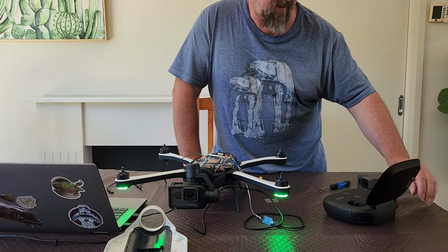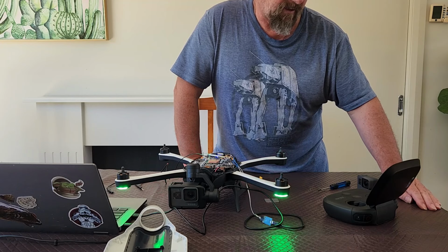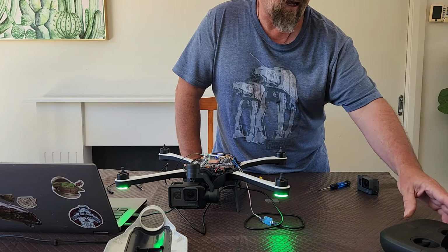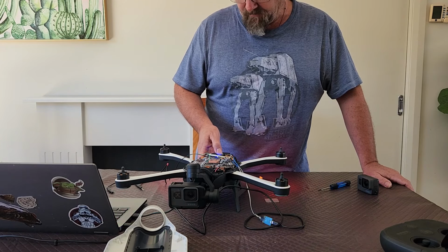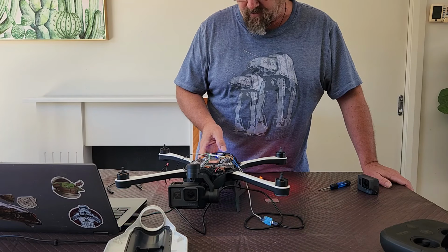and it says, make sure Karma is powered off, then power on and hold the button for 8 seconds until the lights on the arm start to blink. So they're doing that, and then it says, press the power button on the Karma. When pairing is complete, the button flashes green. So, you'll notice this has gone to blue, which means that they know about each other.